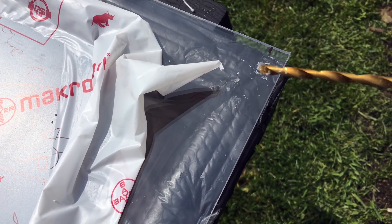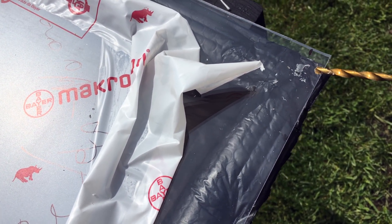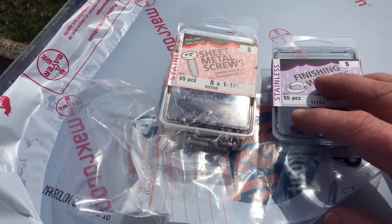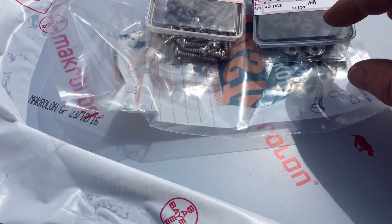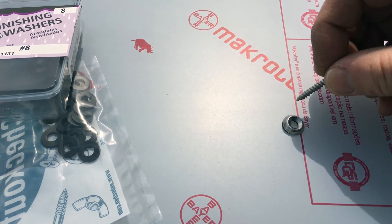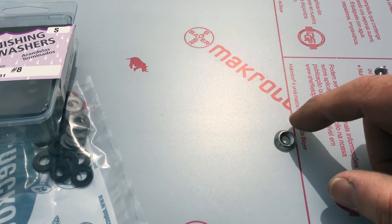I've gone ahead and used a little bigger bit here — this is 11/64th. I'm just going through these holes and making them a little bigger because I want the hardware to drop through, then I'll drill down with the original bit and make sure the screws fit. I'm using number 8, 1-1/4 inch screws, everything stainless, with a fender washer. I'm also using these rubber grommets — they fit very nicely in there and then the screw goes down through. The hardware store had something similar but it wasn't stainless, so I decided to do my own.